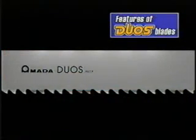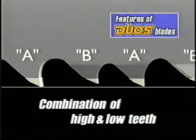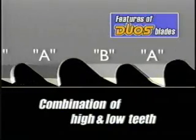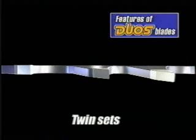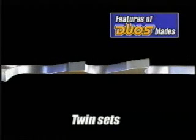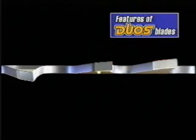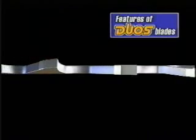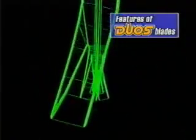The DUOS blades feature two characteristics in their form. One consists of the use of both high and low teeth, and the other consists of twin set teeth where the teeth have differing amounts of set. In addition, the tooth indicated by B here has a smaller amount of set than the tooth indicated by A. A cross-section view of the blade shows how the B teeth are hidden behind the A teeth.